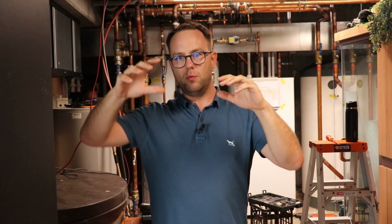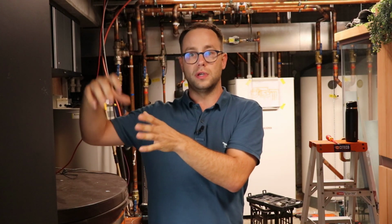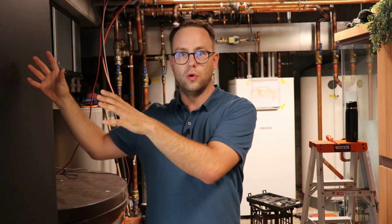And actually, that part of the system was, when you looked at all of the pipes, even though it was a bit all over the shop, when we traced the route of all the pipes, they were connected to the right ports of the tank, to the right ports of the heat pump. That was all fine. But then when you go past the tanks, so it goes to the pool heating or the domestic hot water or the floor heating and cooling, the size of the pipes, the size of the pumps, the way that the circuits were designed, they're all a bit off, which meant that some of the pumps had to be oversized. So you had huge, massive pumps where you would normally use the smallest pump you can buy.